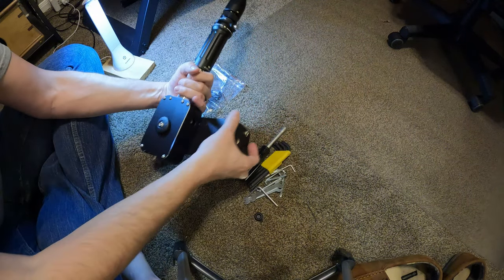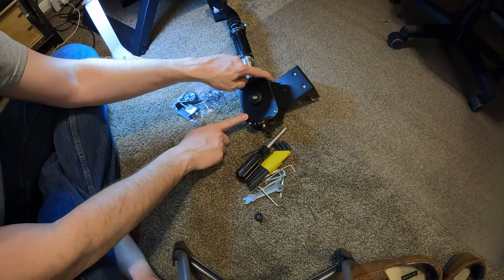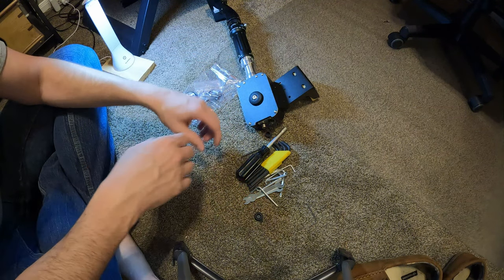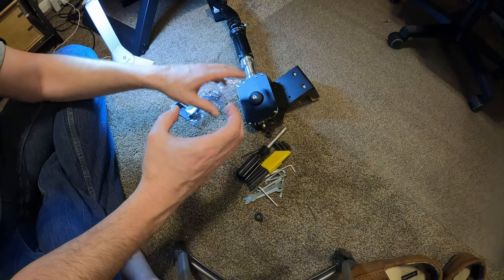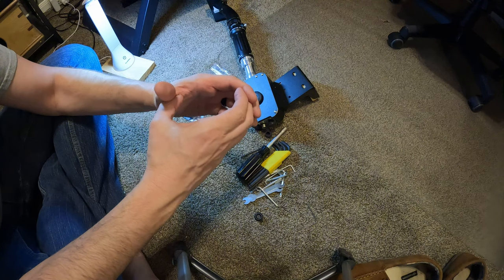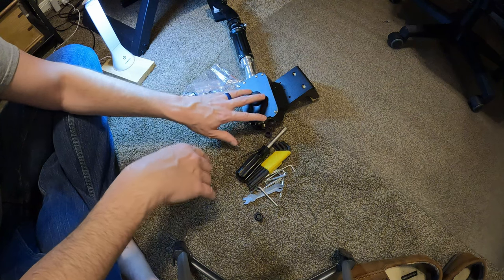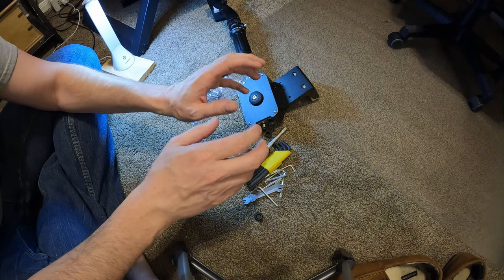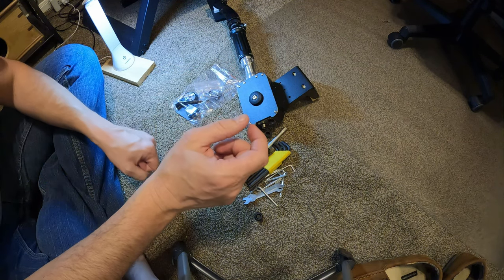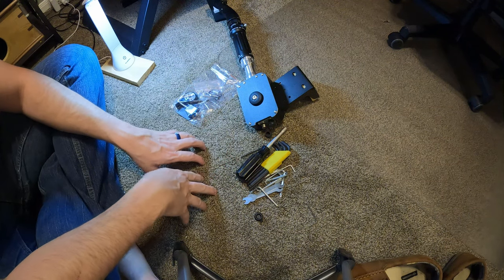And it's just two friction blocks that are sandwiched together, and you have to tighten and loosen these with equal turns in order to adjust it. In order to get this thing to stay put, you have to have enough friction on it so that it doesn't fall down under its own weight. I have mine set to just that point. The only thing with that is, as you try to move it, especially with fine precision, it tends to feel a little sticky, like you gotta give it a little extra force in order to get it to move again.